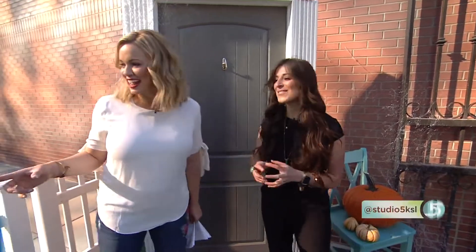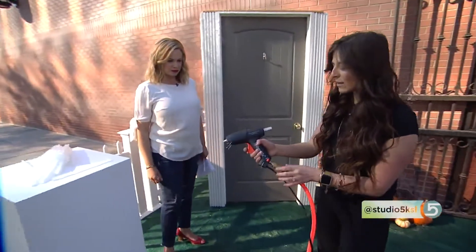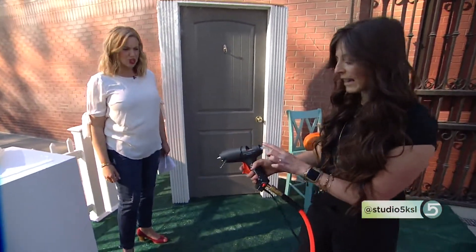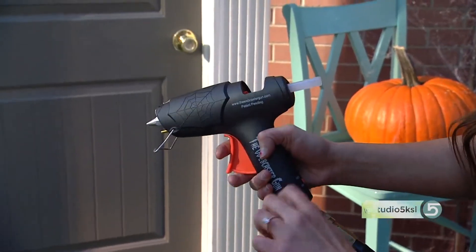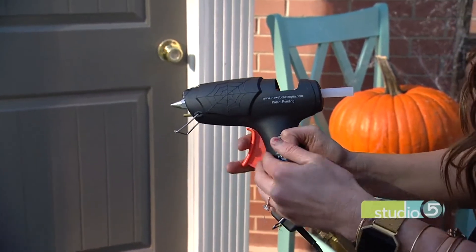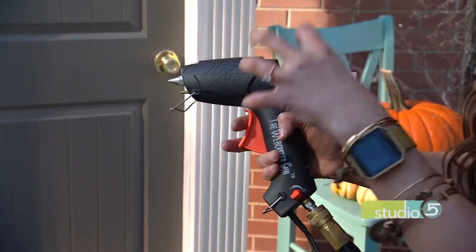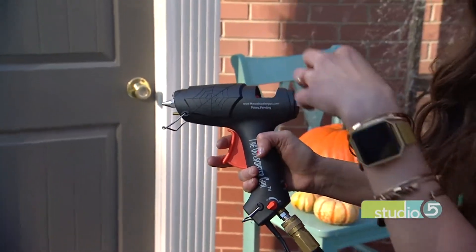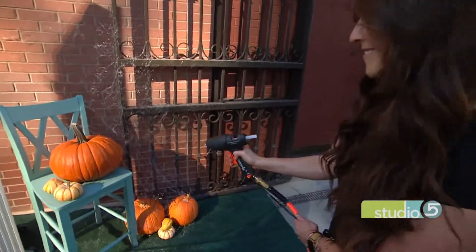We don't have our Ghostbuster suits, we don't have our safety goggles — not needed, I should emphasize. But can we see how this works? Absolutely. So we have it on, it's heated up. Once you turn the air on, I can start shooting. The key is you want to do a constant squeeze, because that lets out a constant flow of glue. You don't want to do just a burst or it's going to throw a blob — steady Eddie.